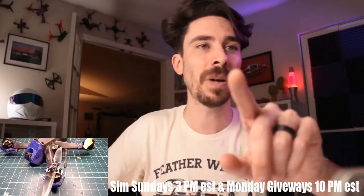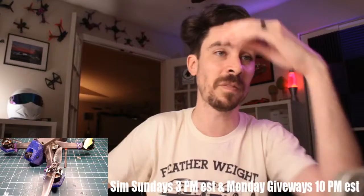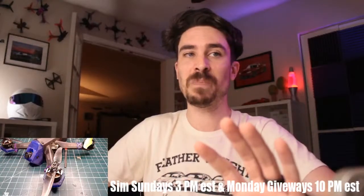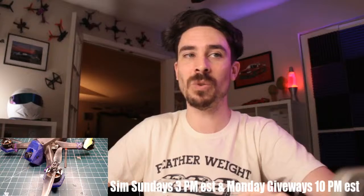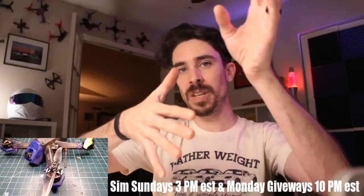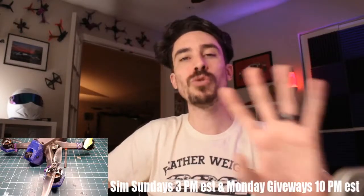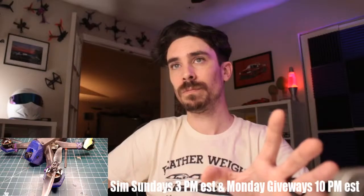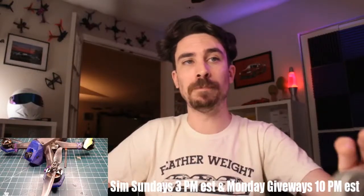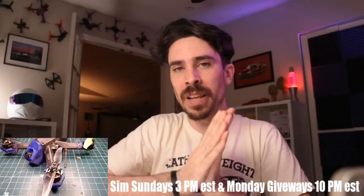BH Hitting is back. I haven't seen you in a minute, brother. How you been? Need your help building a Cinesplorer and was about to install the brand new AIO flight controller. Wanted to test it first, and when I plugged it into Betaflight, the quad screen is slow and laggy and doesn't match up with the movements I'm making in real life. Any ideas or bad board? It sounds like when you tilt it right, it's not tilting right. Check the board orientation, but I don't think that's it. I think it's broken, but play around with the board orientation a bunch, just to make sure. I have had flight controllers before where they're slow and laggy. I don't remember if I retired those flight controllers though.